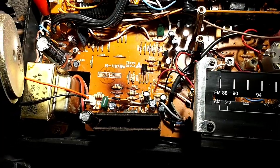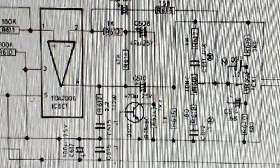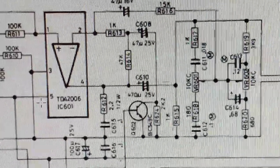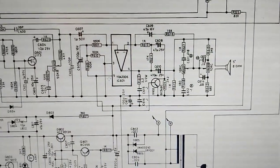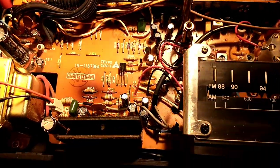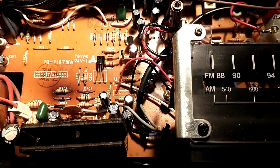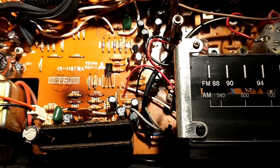Let's check what Q602 does — Q602 works in the audio output stage. This is actually a BC549, which is an NPN. The fact that we have negative voltage on the base would suggest that this is off. It looks like it's the output of the amplifier, so it's designed to mute things. It could be in mute because the machine isn't powering up or responding worth a damn. We need to take a look at what actually controls the power to this machine.